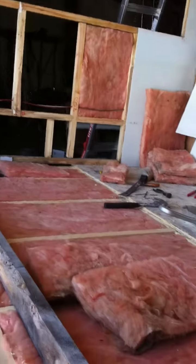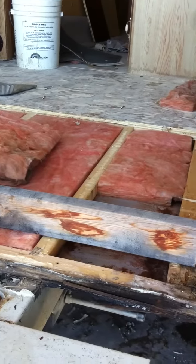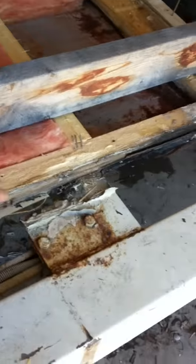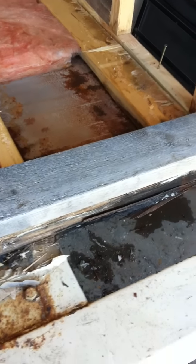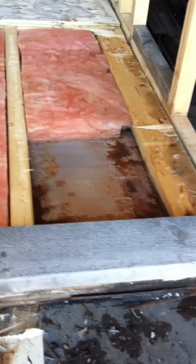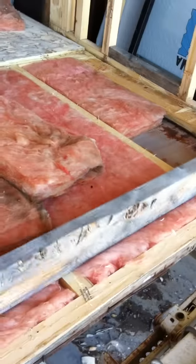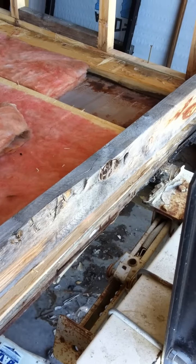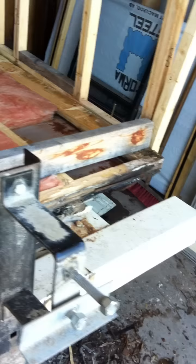So yeah, a little bit of an issue. I'm really tempted to address it, but what I'm thinking I'm going to do is put a two-by-four in the back here — just take this two-by-two piece out, put the two-by-four down like this, cut these a little bit shorter so the two-by-four fits in place of the two-by-two, and put the new piece of plywood floor on. Then on top of that, run another piece of two-by-four sitting on top of the floor, fastened by screws and glue from the back. That will give the rear end of the floor a really strong member to carry some weight.